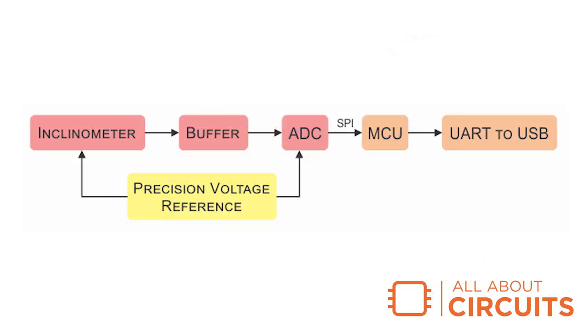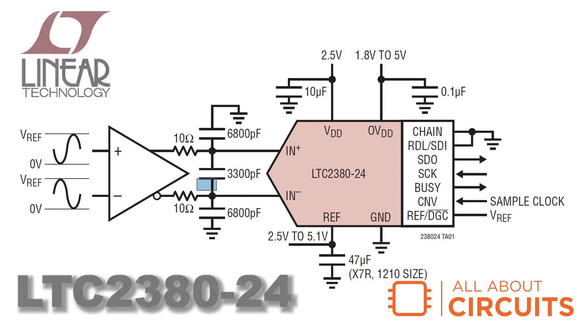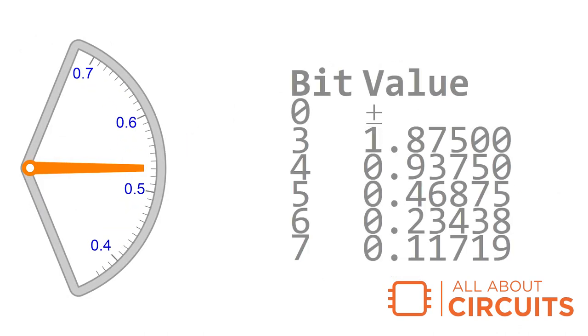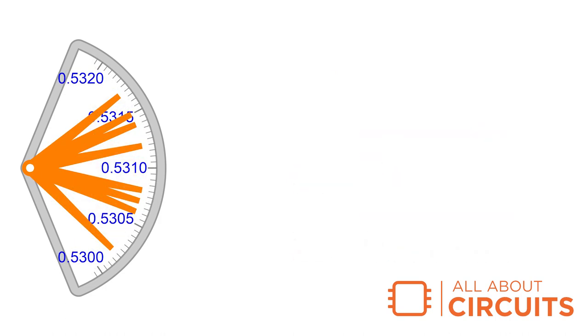To achieve the full precision of the device, an external ADC must be added to the design. In this case, the LTC2380IDE-24, a 24-bit successive approximation register ADC by Linear Technologies. I realized that the 24-bit resolution falls below the noise floor and many bits will have to be discarded, but since I only made one board, I wanted to test the upper limits of resolution.